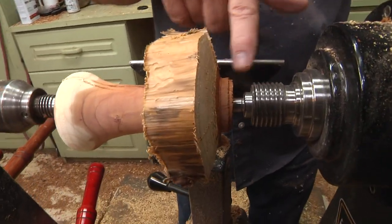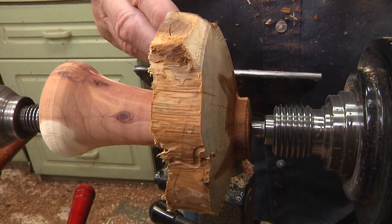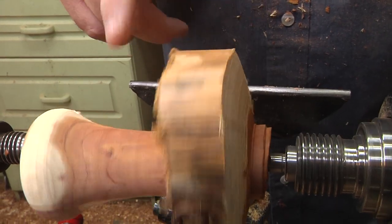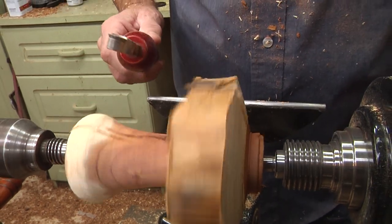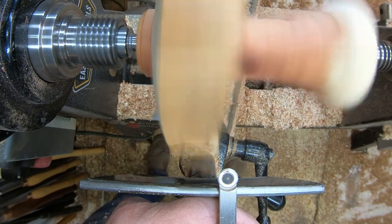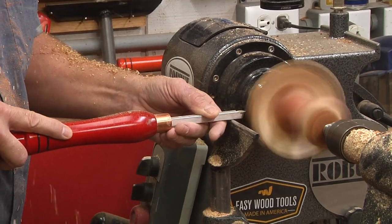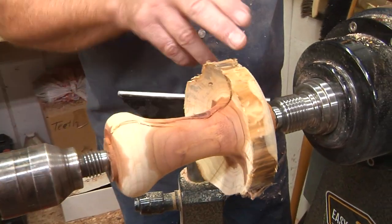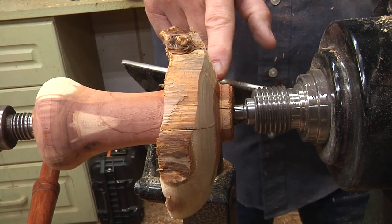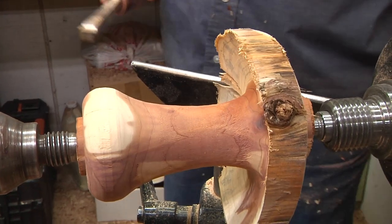We got our curve, but I had to leave that thick because we got a hole in there from the drive center. Looking at this rough edge — it doesn't feel exactly like a mushroom. I started doing a test to round this edge a bit from this side. We'll get round on some parts and rough on other parts. We'll use our negative rake scraper to do that because it's really delicate work. I actually mounted it off center one more time to get into this side, round that edge and make it thinner so it's more uniform all the way around. All I have to do now is nibble this down a bit, do the same on the other end, then sand the top and the bottom.